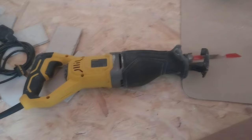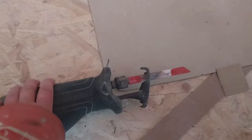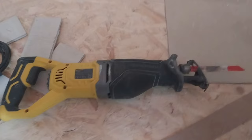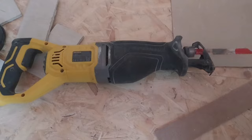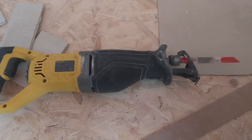The tool I'll be using for cutting out the openings for the window is my reciprocating saw, which is a bit of a beast. I've got a metal cutting blade in there — this one's already been well used so I'll change it for a new one. It's good for quickly cutting through GRP. I'm not too bothered about getting too straight a line at this point in time, because I can always get it smooth with a sanding disc in my angle grinder, which is going to be much faster.